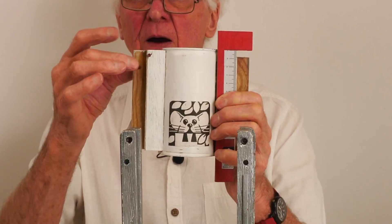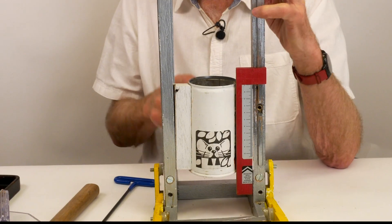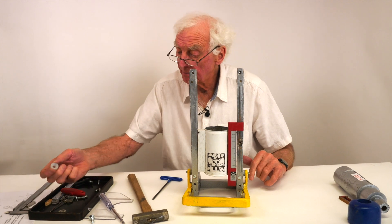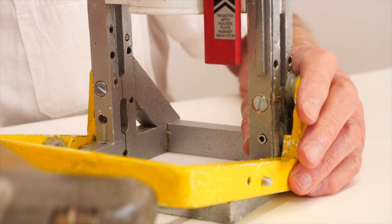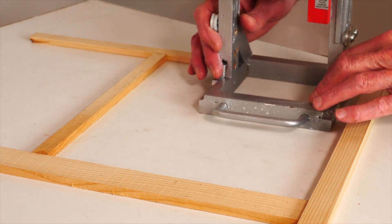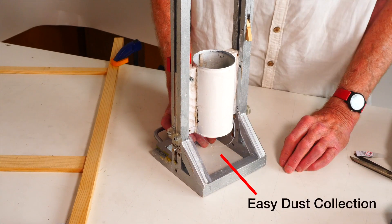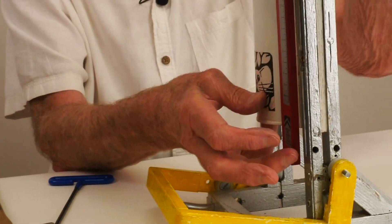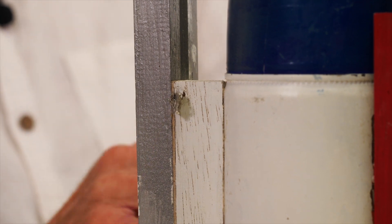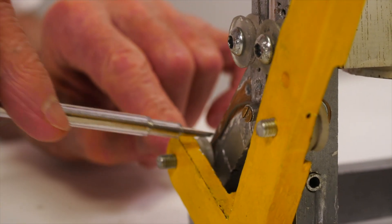This is the motor housing in the middle with two fins on either side, and the fins fit down in the slots between the two towers. With the motor housing in place, we can then put the wheels in place at the top, and then we need the wheels for the bottom. The square base contacts straight edges and templates when going freehand, and its geometric shapes are easy to shield for dust collection. That's the motor housing rising and falling. We can put the cap on, then take the wire up and round, then down underneath and up.